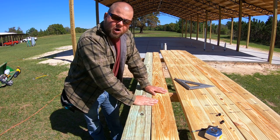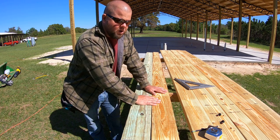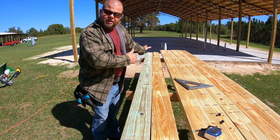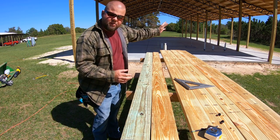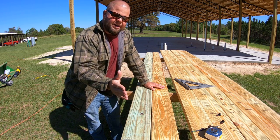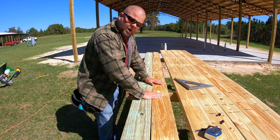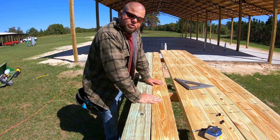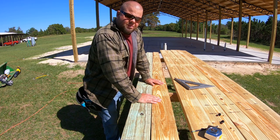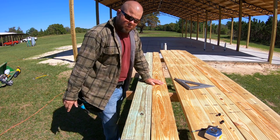The plans call for 16-inch on-center studs. Here lies one issue of a pole barn house: we can't just lay out 16 inches and raise a wall all the way down like a traditional stick-frame house, because we have poles everywhere. The top and bottom plates are slightly off, and if I just start laying out 16-inch on-center studs without accounting for the posts, that's really going to mess up my sheathing.